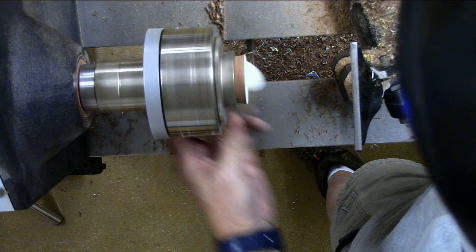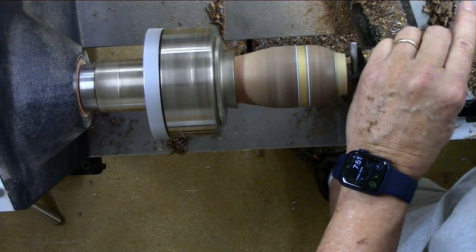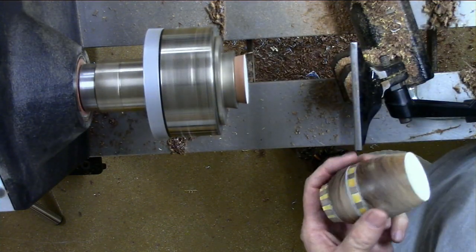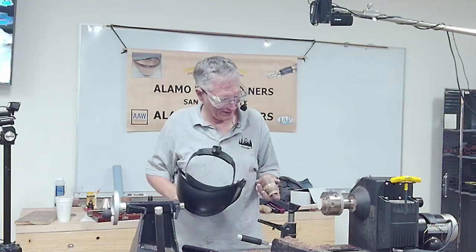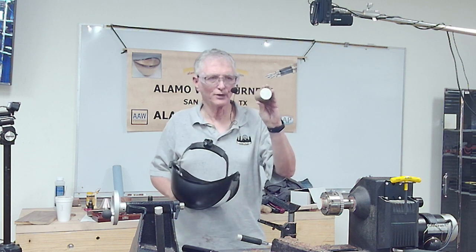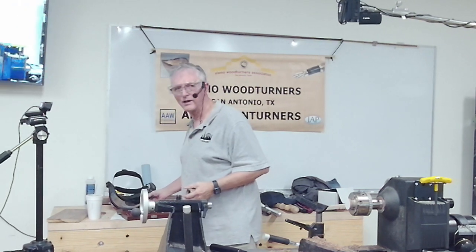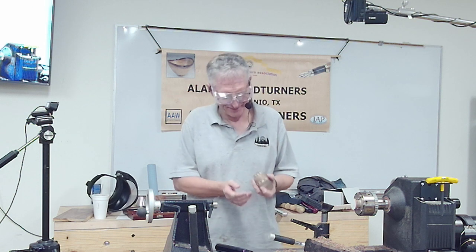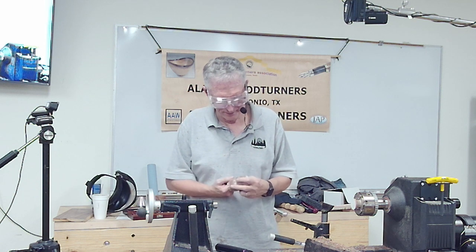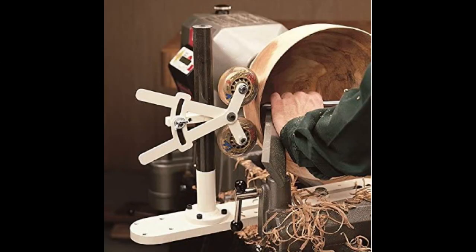Wish it was this easy to put it back together. Well, I'll be making a new tenon. The trouble with paper joints is that they are designed to break off easily. I used too much lateral force and this caused the joint to fail. I have made 12 of these transition vessels, and now I use a one-way bowl steady rest to provide support during the hollowing process.